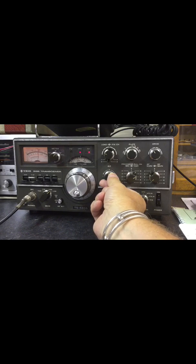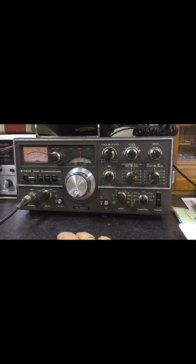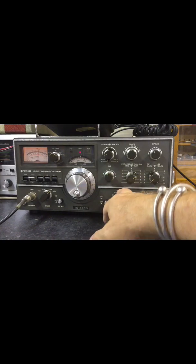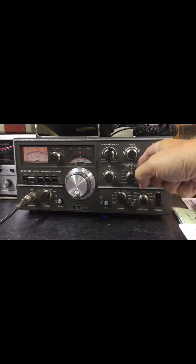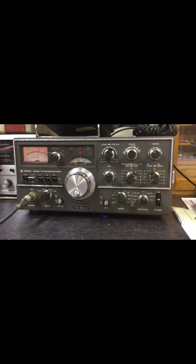She's not talking because I'm making a video. It's as easy as that — that's how easy it is to set one of these up. Normally if I change band, say to the 20-metre band, set the plate, set that to minimum, set drive midway, have the carrier about three-quarters of the way — and going through tune, CW, and then your band, using the ALC, plate current, and then RF, plus setting up the MFJ tuner — it takes seconds. Maybe 30 seconds, 45 seconds.